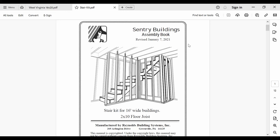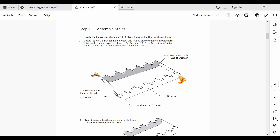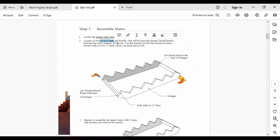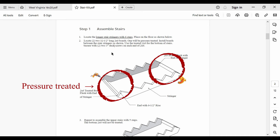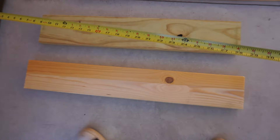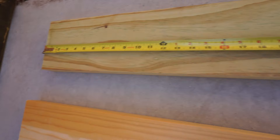Now let's proceed to the stair kit instructions, which is a separate document focusing only on the stairs and the floor of the loft. For step one, find the stringers with six steps — count them out to be sure, because there's also a set with fewer steps included. Pay close attention to how these 2x6 inch boards are oriented relative to the stringers, and make sure the bottom one is pressure treated. The bottom of the stringer is slightly less tall than the rest of the steps — mine was about 6.5 inches tall. Use the 32.5 inch long boards here; there are boards with similar lengths in the kit so be careful not to mix them up.